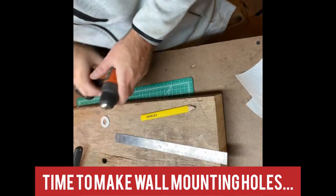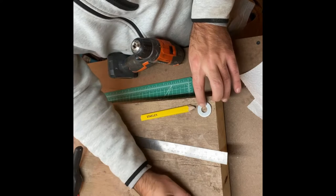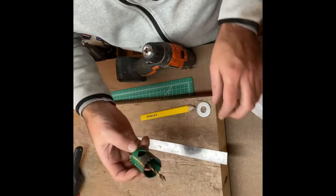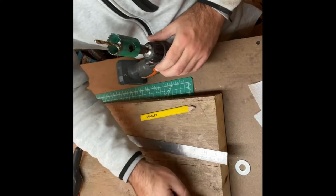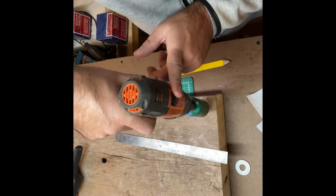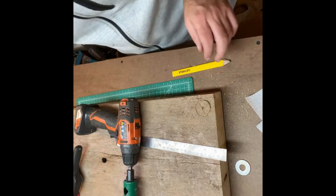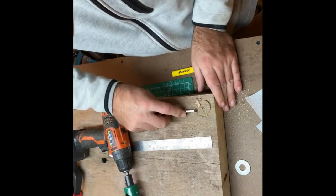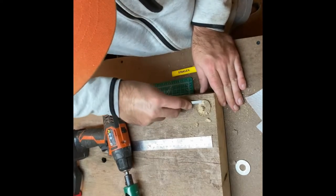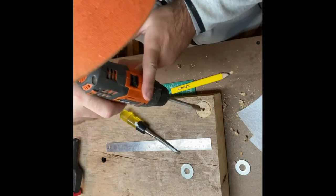We're at the back of the wine rack. We're going to drill a hole down and have these sunk into the wood, with a hole in there — that's how it's going to be hanging from the back. One and a half inch drill, so that one and a half is the same size as the outer ring. I've already pre-marked these. Not going very deep, barely going in there because the washer is pretty flat. I'll just chisel this out, and make sure the piece is sunk to give it a place for the nail when I hang it on the wall.